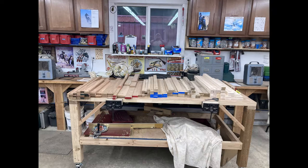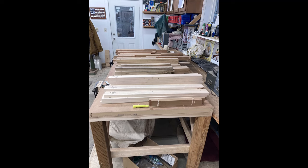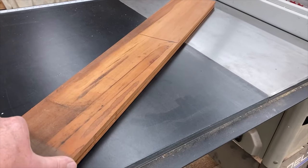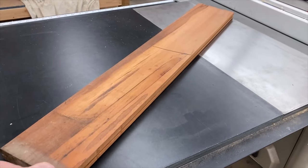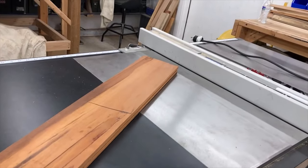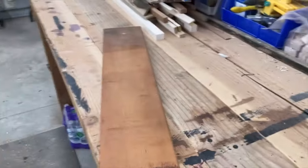Now that I've got the floating bottom and the keeper ring installed in the first ring of the vessel, it's time to start milling up the rest of the lumber. So this is the tigerwood flooring, decking, that I got years ago. I love it because it's a good hardwood. It's got some nice accent colors, but it is twisted pretty much. But I take it running on the jointer until I get rid of the groove that's cut in it for the flooring, decking, and I get it nice and flat on that one side like that,